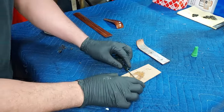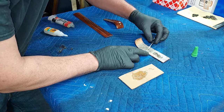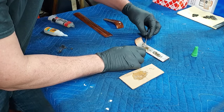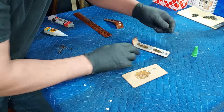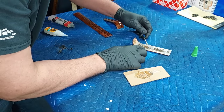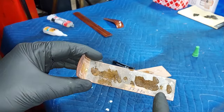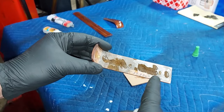The super glue holds it in place while the epoxy dries. Then rub in just a little film of epoxy right in the center — don't get too close to the edges or it'll squirt out. Just a little right in the middle and a little over here. You don't need to go crazy — this stuff is very strong. Then go install the piece: I did a dot of super glue there, there, and there, and hold it for about 60 seconds while that sets.